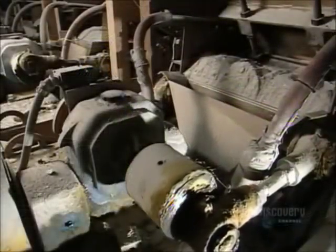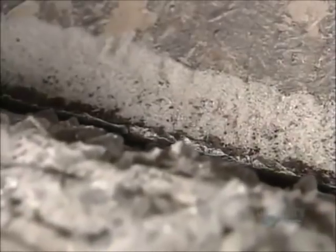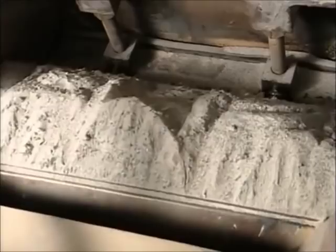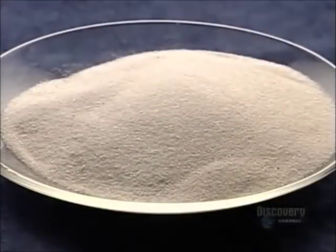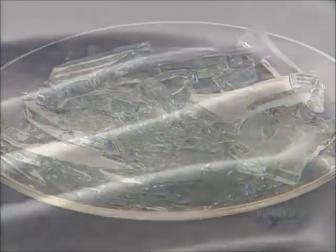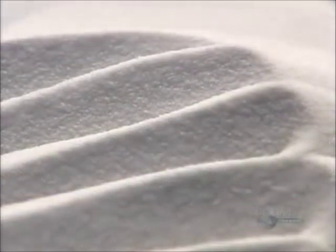To whip up some dishes, a batch feeder pushes ingredients into a big furnace as they spill out of a bin overhead. Silica sand is the biggest part of the mix. It's a crystalline substance and it makes glass transparent. The batch also includes soda ash and recycled glass. Some of the other ingredients are a trade secret.